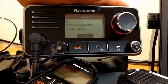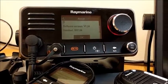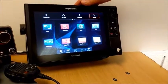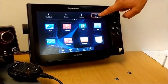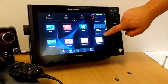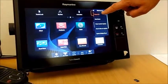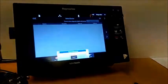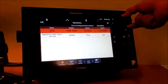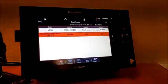Don't forget the bootloader file which we have to upgrade first. Let's come around to our multi-function display. This is connected to the radio via a small SeaTalkNG backbone which has its own terminators, power and the expected parts connected. If I go to setup, maintenance, diagnostics and select device — on here I can see my ES128 and my Ray70 VHF running application 1.24.